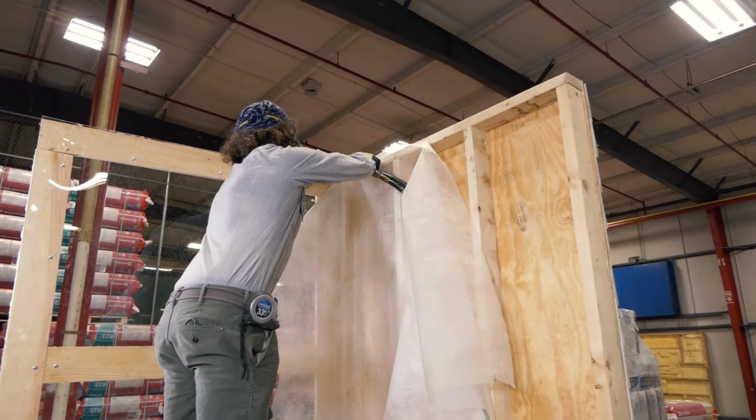A breathable mesh webbing can be applied over the stud bays, tightly stapled in place. Other materials can be used, whether it's in new construction or retrofit work. Using a breathable material is ideal. Various house wraps work, as well as many of the smart membranes that are out there.